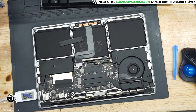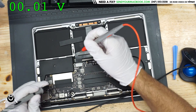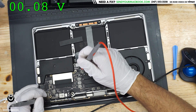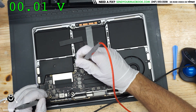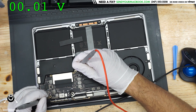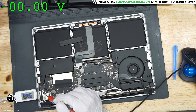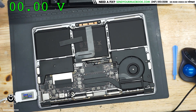We have 20 milliamps being drawn - wonder why we're only getting 20 milliamps. Let's see what our PP bus G3 hot is. Our PP bus appears to be zero volts, yet we're at 19.94 volts. So our CD3215s are likely doing their job, which means PP3V3_G3hot is present.